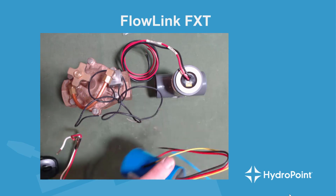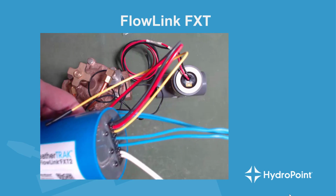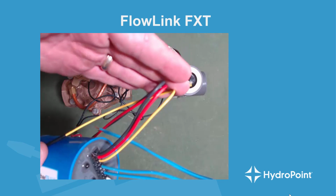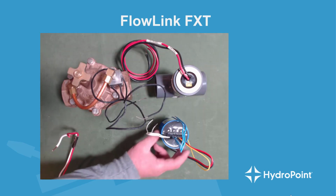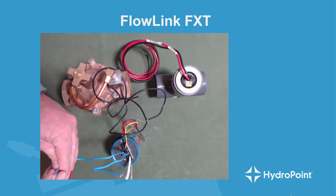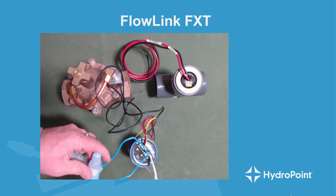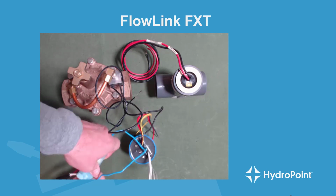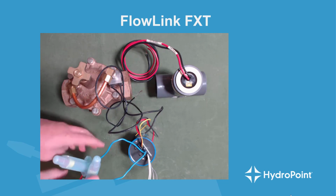If you look closely at your FXT, you'll notice that there are three sets of wires. The blue wires in the middle will power up the unit, the white wires will work the master valve, and the red and black wires are for your flow sensor. So the first thing I do is I take my FXT and I wire up the power wires, one to the common and one to the hot. And when I'm using my DBRY wire connectors, I make sure that the wire gets pushed all the way to the top of the tube, and I make sure that the bottom is locked tight to seal out any water or other possible contaminants from those connections.